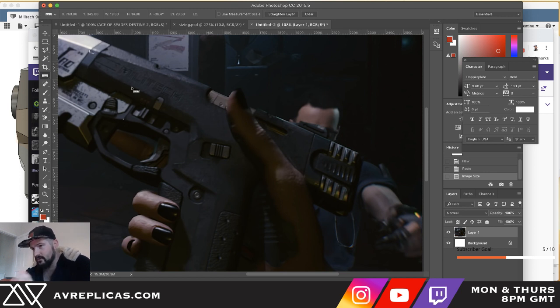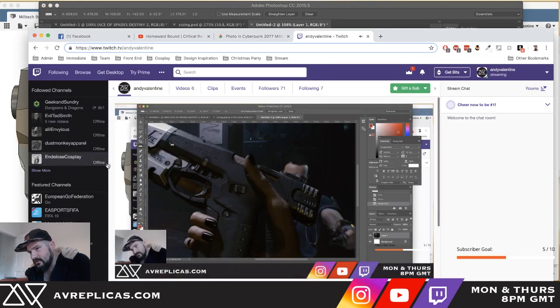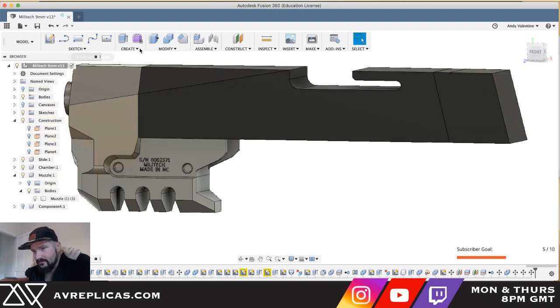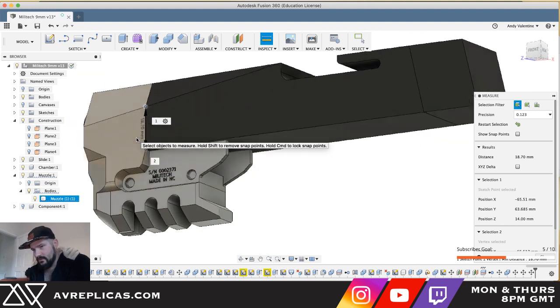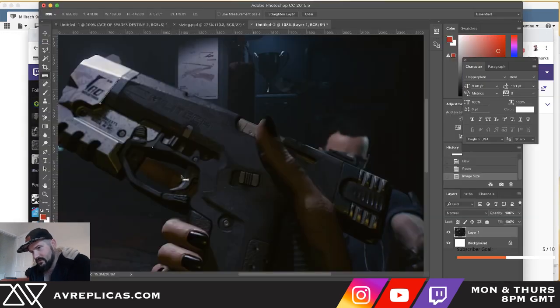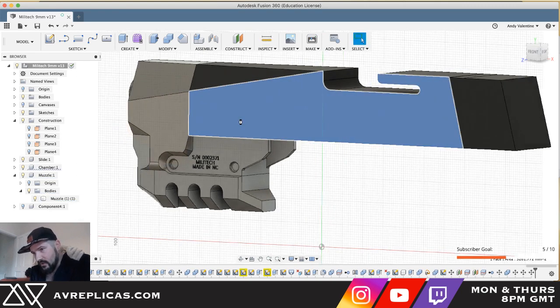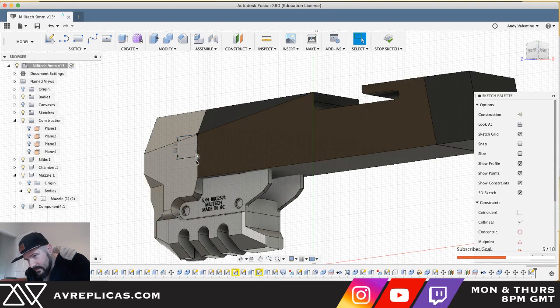Actually, I need to do the whole thing - cut the piece off and then do it because this needs to all consistently cut away here. So this now has a height of 18 - let me just check that on my newly sized piece. 18, great. So I can actually measure this both vertically and horizontally. This cut-out here comes down to 9.5. I'm just going to mark that - 9.5 - so that's where the cut away starts, going from here back to here.